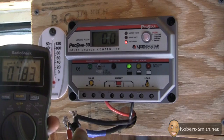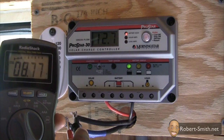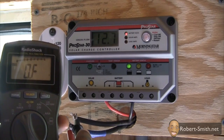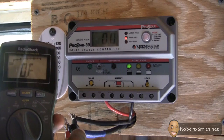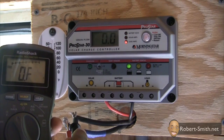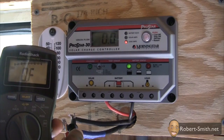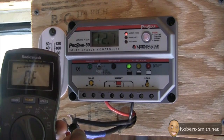I've been getting more than 10 amps, so that's a good thing. Like I said, I should be getting 9.3 amps on average. There are a lot of clouds in the sky, so the values are fluctuating up and down, but I was hoping to at least get over 9.3 — and as you can see it almost just reached 10, so it just cut off to protect the multimeter. Basically everything is good. It is getting over the average, which tells me the solar panels are still working as they should.